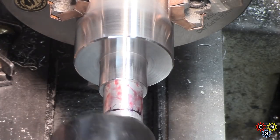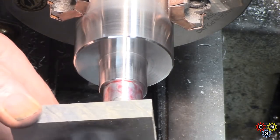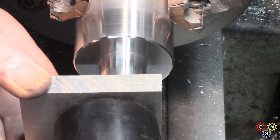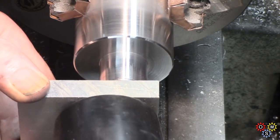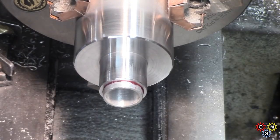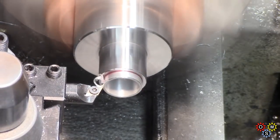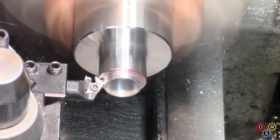Time to get the tube in, and this end of the tube is slightly plus so that it's a very light interference fit, and the mark you can see there is my limit, so the tube's actually very close to the bottom, probably not quite touching.